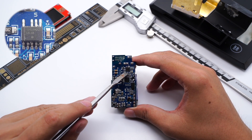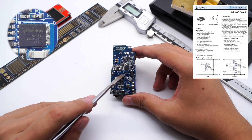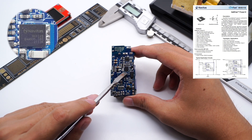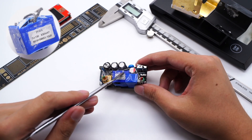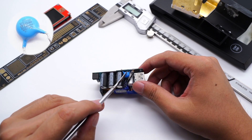The master control chip comes from ON Semiconductor, the NCP1342, which is a highly integrated quasi-resonant flyback controller. It integrates an active extra capacitor discharge feature and has complete protection functions. The primary switch transistor is a Navitas NV6115 in a 5×6mm QFN package. This is a GaN IC that integrates an independent driver and complex logic control circuit. The GaN FET inside is rated 170mΩ 650V, and it supports 5–15V input and a 2MHz switching frequency. Here is the transformer. There is an optocoupler between the primary and secondary circuit used to feed back output voltage. The blue-white capacitor is used for output anti-interference.